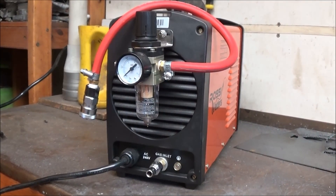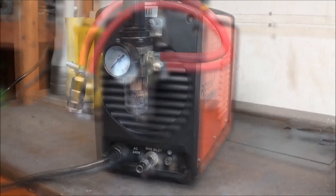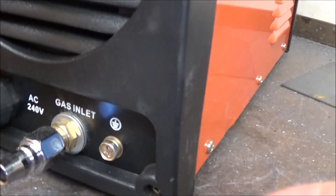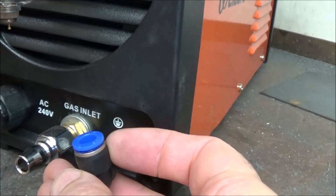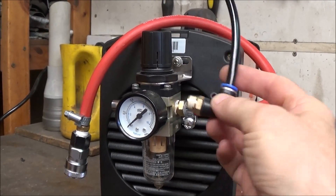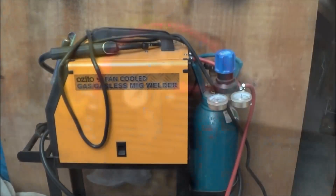This is the back of the machine and it comes with an air regulator for the plasma cutting. I found that the connections were completely useless, so I replaced them with all airline type connections. They originally came with just these useless-looking things where you're supposed to poke a bit of hose into it for the airline, and the same thing for the regulator — just these little connections on it. I took the bits to a welding supplies shop and they supplied me with all the right bits. Another $60 later.